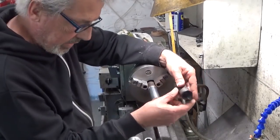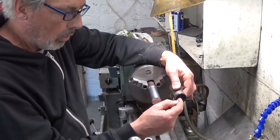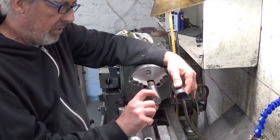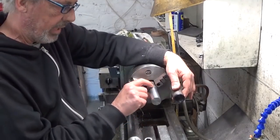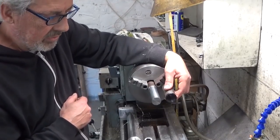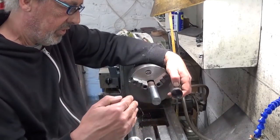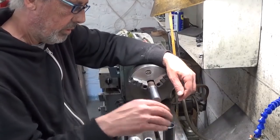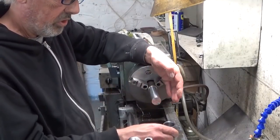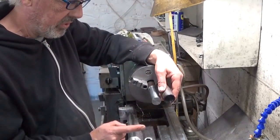It was like this in the lathe, yeah? This inside boring is smaller than the backside. My cylinder, this side is bigger than the backside. That's not logic. That doesn't make any sense to me. Normally, you should say the taper is, let me put this way, huh? The taper is that way, yeah? Big here, small here, which means in my boring should be the same, but it isn't.